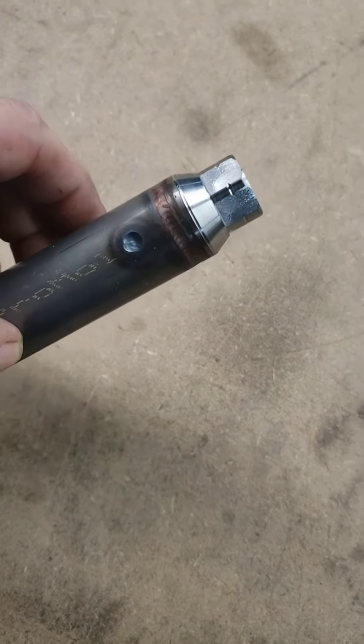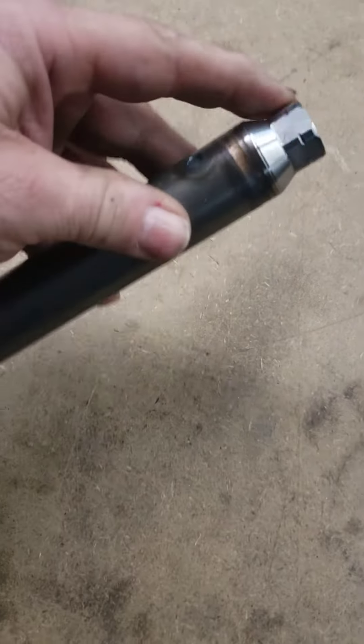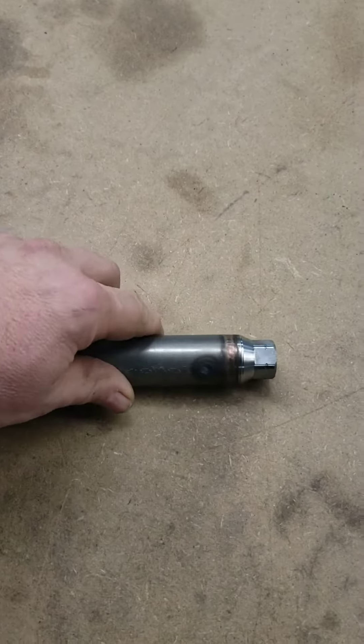We've got the groove for left-hand thread. The most important thing we're doing now is putting a slug in here that's solid, welding it, then machining it — that way it'll keep everything nice and straight.